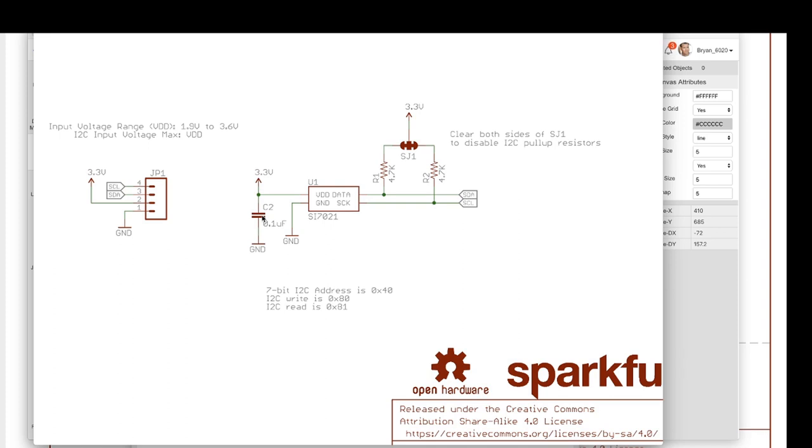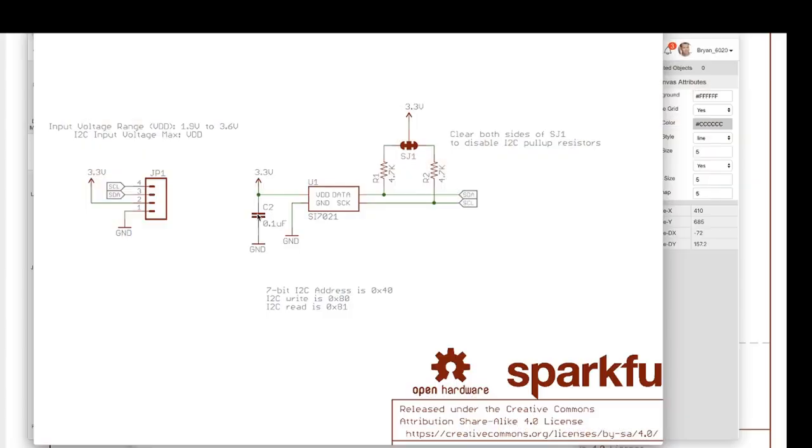As I mentioned, digital circuits have a very limited range that they need to operate within. And this chip needs constant power. A capacitor works like a fast-acting battery. So if there's a power drop because we turn something on elsewhere and the power jumps to that or whatever, there can be a dropout in the power. As soon as the capacitor senses that there's a dropout, it dumps its voltage into that line, so it serves as a buffer to make sure that there is a constant power source. And as I said, this is called a decoupling capacitor.